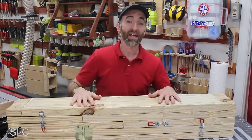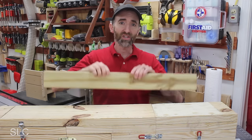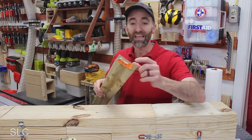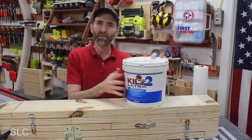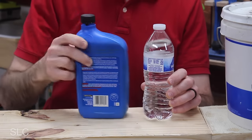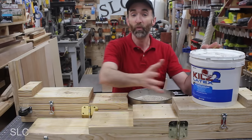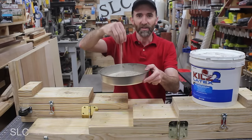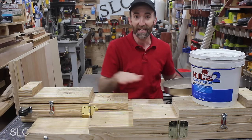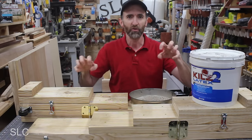A bunch of you asked about adding some kind of paint or protectant to the wood, and that is a great idea. I normally keep my ramps in a dry garage, but if you can't do that here are some suggestions. If your ramps will be exposed to weather, I'd suggest building them out of pressure treated lumber — just check the end of the boards and make sure the labels say ground contact. That should make them last a lot longer. Otherwise, consider coating them in latex paint, which helps protect against water or oil dripping from your car. I was also given a great suggestion to take just a little bit of sand and do a light layer on the top side where your tires roll, which will help your tires grip much more easily.